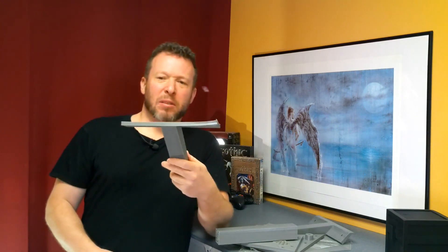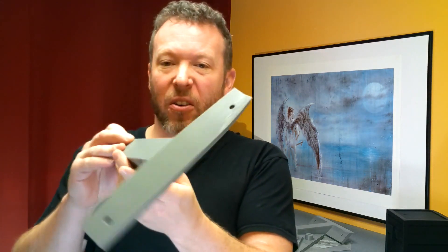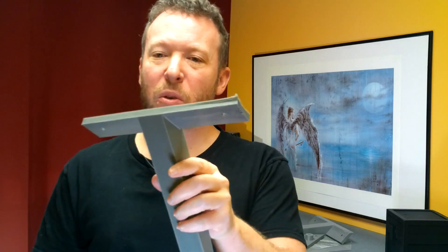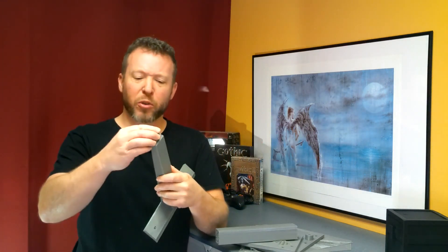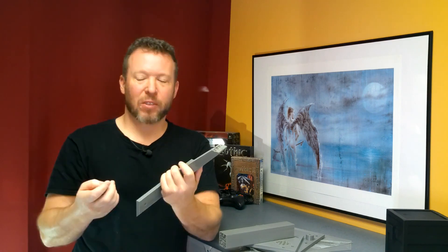We have for instance this piece, which for no better reason I don't know why, worked out well all over the place except for that one corner where it didn't stick to the bed very well, and then it deformed. Maybe it was a bed that was not really clean, or the temperature difference is for some filaments more crucial than for others. Then we have a part like this where, due to my own stupidity and design failure, I cracked it in half. Not fantastic.